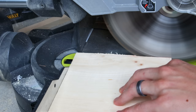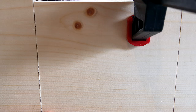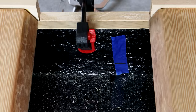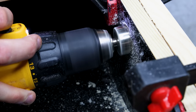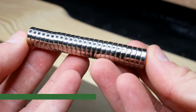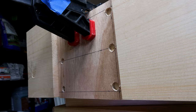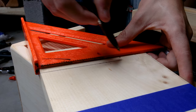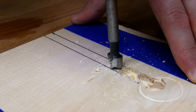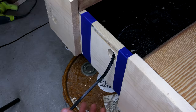I shaved a little off the top for proper alignment and ensured the grain remained consistent across each piece. I still needed a way for the pump's cord to exit the table seamlessly. I measured for the overflow height and marked for that on the back, using it as reference as I drilled a hole that has to be far above the waterline. Neodymium magnets are the best solution I could think of — I used a guide to create holes for them on both surfaces and put dots on the ends as a reference for their polarity. I also made a trench for the cord to run through with a drill and chisel. It hides everything while giving full access to the pump.